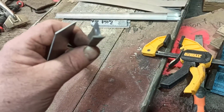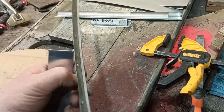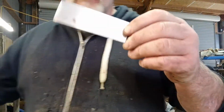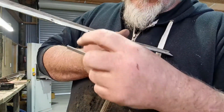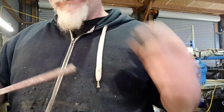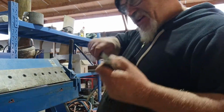It's just awkward because I haven't got that hydraulic clamp to squash it. But if I'm gentle, I think we'll get it. So we'll have a play with that now. I've measured that up and got my marks in there, so just a test play. First mark's that one, and then basically bending it up that way, and then I'll have to do that double break to get it to about 45 degrees or thereabouts at a time until I can fold that piece as hard over as I can.